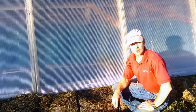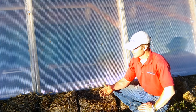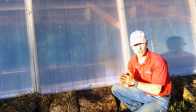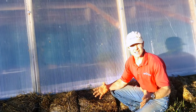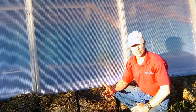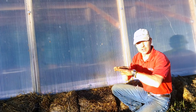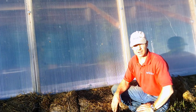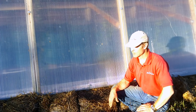This front wall is 8mm twin-walled polycarbonate. We went with twin-walled — it's a little more expensive but it's actually got an R-value of R2. You'd be surprised how much cold can get through if you just use plastic. If you do use plastic, you need to pull it tight and it's probably best to have two layers. You also look at transmissivity — how much solar energy is actually getting through that surface — and strength, because you're going to get a snow load. With a 60-degree front wall, not a lot of snow load, but the top side is only 30 degrees so you'll get some. We've been really happy with this — it's very durable. We've had some really high winds here, and we haven't lost a panel in five years.